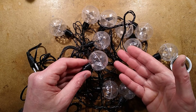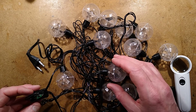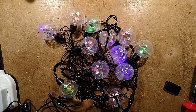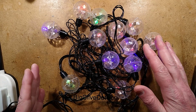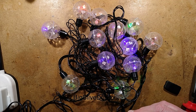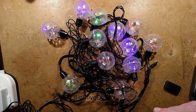And that's fundamentally it - they're using self-flashing LEDs. The reason they've got that little capacitor across the output is because if they don't have at least some capacitance, as the mains crosses the zero crossing point these would all reset so they just stay in one colour. I just pulled the capacitor out and they are actually still flashing - it must just be the capacitance of the cable that's enough to do this. Usually with these things you'll find they alternate backwards and forwards, then just keep resetting to the first colour, but in this instance they seem to be doing okay.